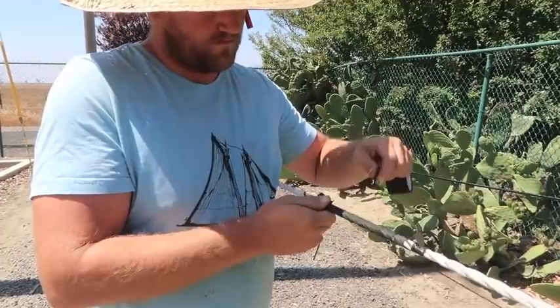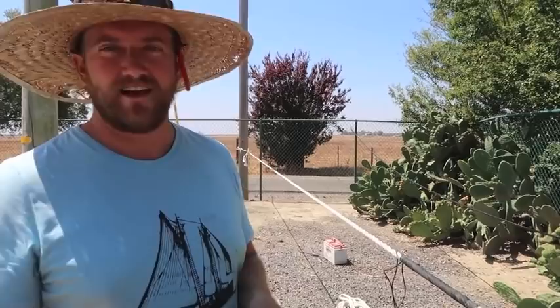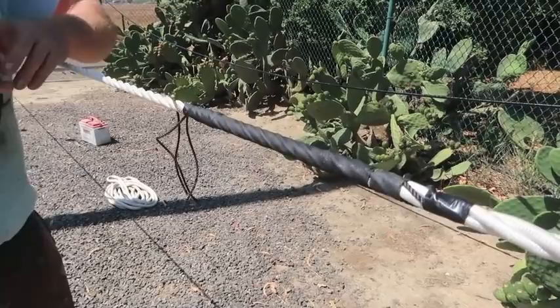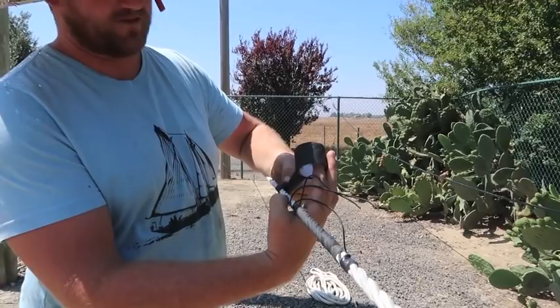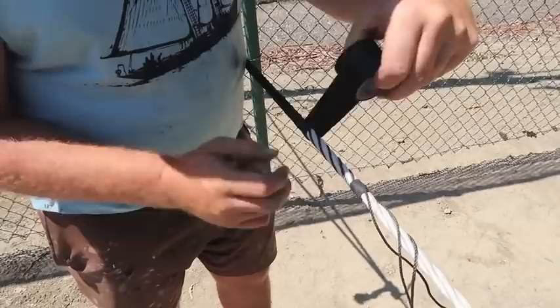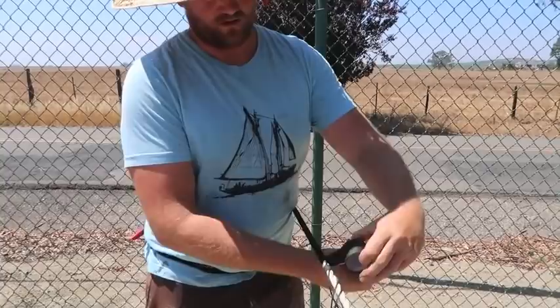We've wormed. Then after we serve it, it's surprising how much tar squeezes out of that tape. Right now it feels pretty dry, but when we put that much compression on it, it squeezes up between the passes. All that serving — and it also gets warmer, and sometimes you even get a clump of it on the mallet. So we've wormed and we've parceled. There's a little saying: you worm and parcel with the lay. This is a right-hand lay, so I'm going to go with the lay — around that way. Serving is just wrapping it crazy tight with more of that twine. Number 36 twine seems to work really well with this 3/8-inch rope.